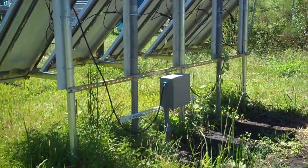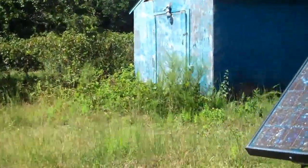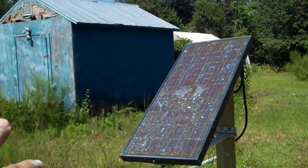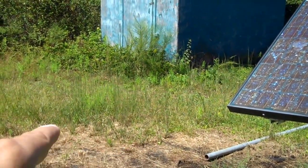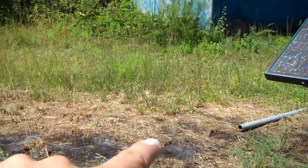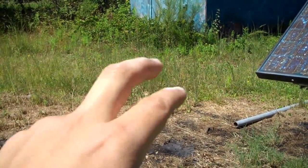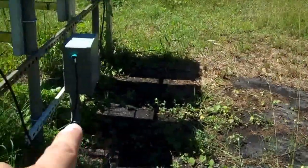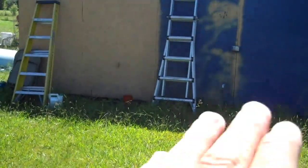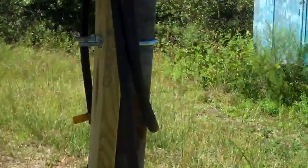Here's my bay of the other panels — the Grape Solar panels and the junction box. I'm going to set up all the panels here in a nice row. That shed is going by the way, and this whole area will basically be my solar panel farm for the future. I'm going to put three to four more posts for future solar panels. Each panel will get a junction box, then I'll use electrical conduit to go underneath into the main junction box, which will run into where my batteries, charge controller, and inverter are in the shed.